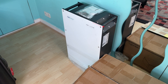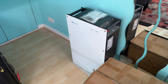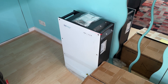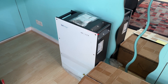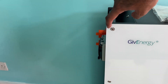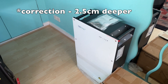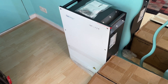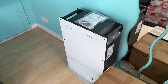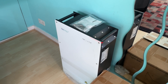Anyway, I thought I'd bring you this update. The good news is the battery is here and it looks exactly the same as the other ones, just bigger. The 9.5 is 80 centimeters tall, which is 18 centimeters taller than the 8.2. It's 48 centimeters wide — exactly the same width as the 8.2. It is about 22 centimeters deep, which I believe is about 4 centimeters deeper than the 8.2. So it'll stick out a little bit when placed side by side. Once I get the cables and get it hooked up, I'll make another video covering what it looks like in real life and what my new installer has to say about the commissioning process.